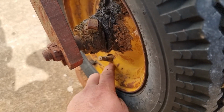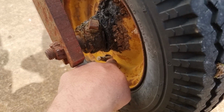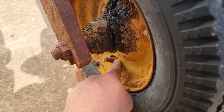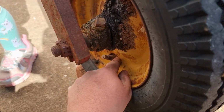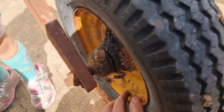It's got a crack in it, you can see around the back corner. They had it turned on the angle, and then all the grease over summer had leaked down and got in there and affected the rubber. So I've got a right angled steel one, which will come out in the angle, and I'm going to backfill the hole with some silicon once I've got it pumped up, and that'll keep any crap out of the rim.